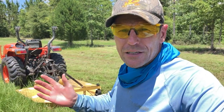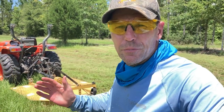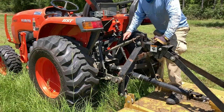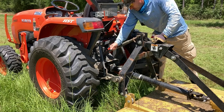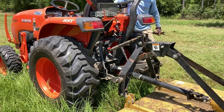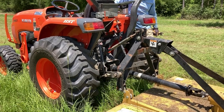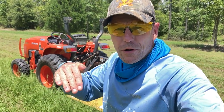So as I stopped the tractor, I turned off the PTO, but then I ran it into some high grass. That just helped it stop the blades quicker so I could work on it. Just going to make this longer. So I lengthened it out about an inch worth of threads, put more downward pressure on the tail wheel, should ride a lot smoother now.